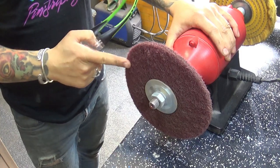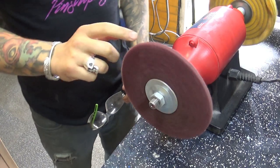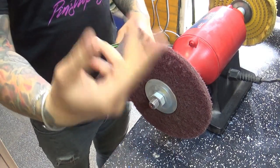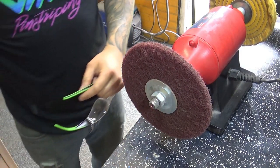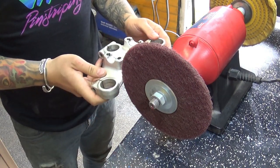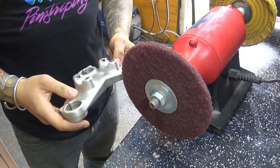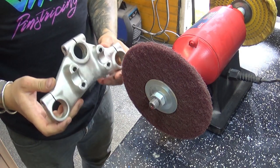Next step is my grinder — grinder or buffer, bench grinder, bench buffer. What I've got here is a scotch brite wheel. It's basically the same thing as your regular red scotch brite, but this is reinforced so it doesn't go flying everywhere. It's a very flexible, very forgiving piece of equipment. The importance of working with it is you need to remember to work one way, because that's going to produce scratches — a brushed aluminum effect — which is what I'm after. I don't want to polish it to a mirror finish; I just want to renew it a little bit and I like the brushed aluminum effect.